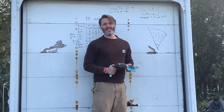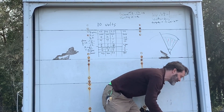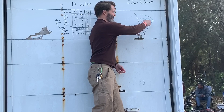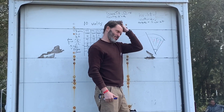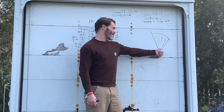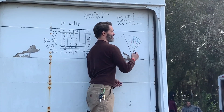How this all works comes down to flux density. When you're running an electric motor, the magnets are only so strong and the back iron that conducts is only so strong. We have our magnetic flux coming out of the rotor, going through a tooth and then conducting through our back iron back through the tooth. With a two-pole motor, you don't want to push past 1.2 teslas at your back iron - that's a constant motor designers work with. Push past that and things saturate; more amps in, you don't get anything more out. Too strong a magnet won't help you because the back iron is saturated.